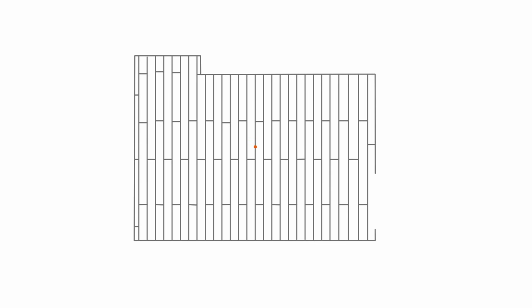We're now ready to start laying the boards. The room is unlikely to be perfectly square and the walls may not be perfectly flat along their length. So we'll start laying the boards in the centre of the room with the hardboard sheets at a right angle to the existing floorboards. To get the starting point, we need to do some measuring and use a chalk line.